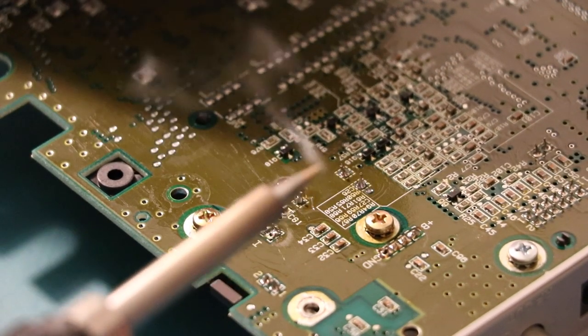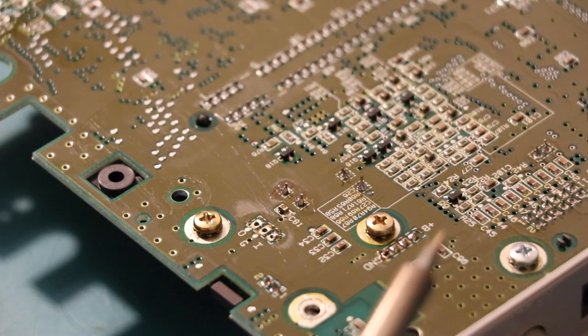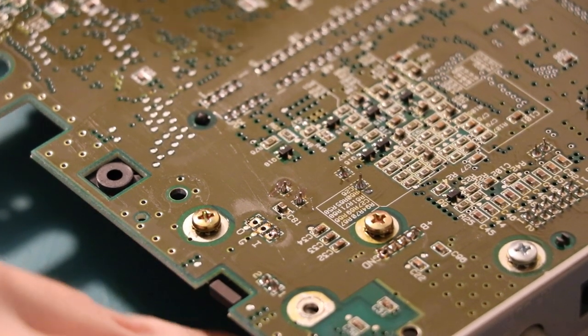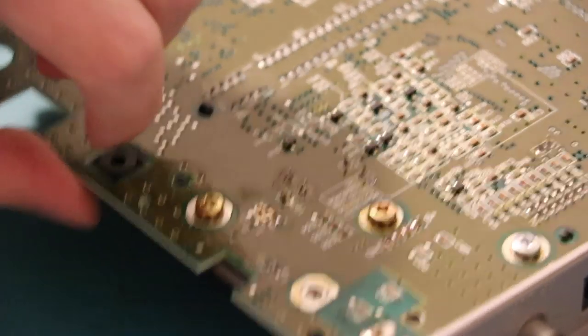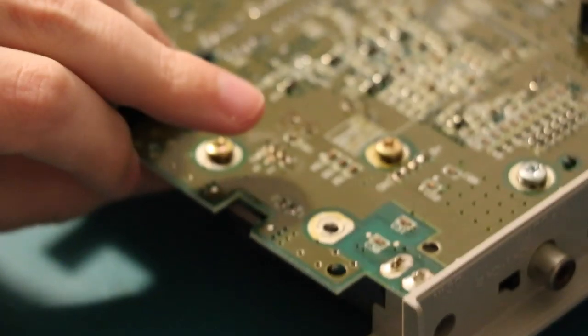Which used to be the... Why would I start with that one? Been out of the game too long. Technically I could just thread it through, which I can't anymore because I blocked the hole with solder, and blue tack it. Oh, there we go. Or you could screw it in. Screwing in would make a lot more sense.